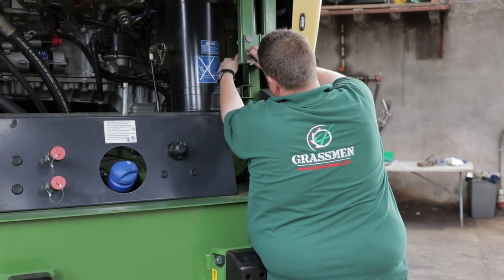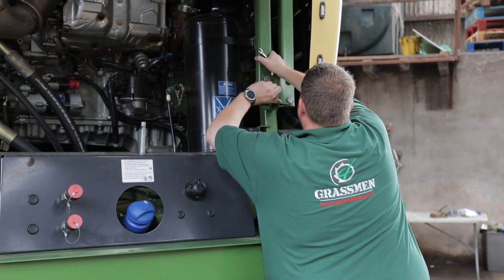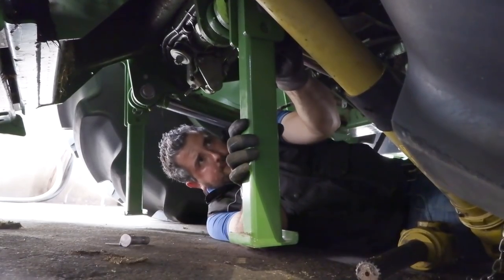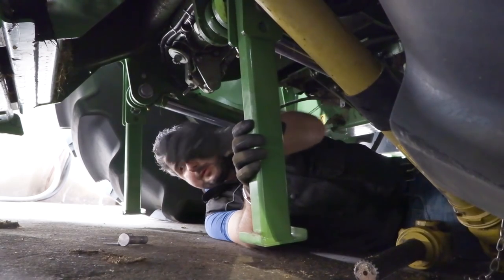There's two stands located in the back of the harvester, so we've lifted them in, passed them in, Gary set the two stands on, and he had two shafts to pull off when he was in there. And once that was done, drop down, reverse out, and there we have the feed rollers sitting on top of the header, and that's us in at the drum.